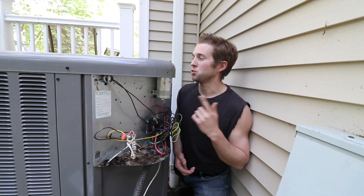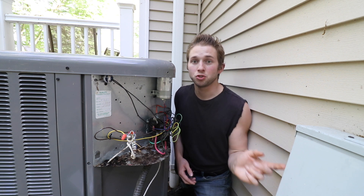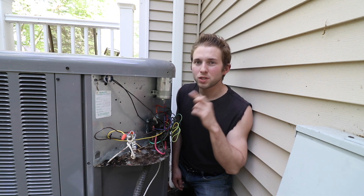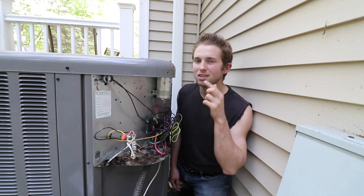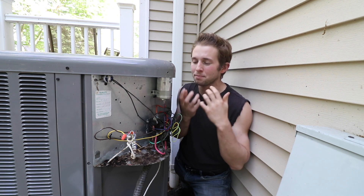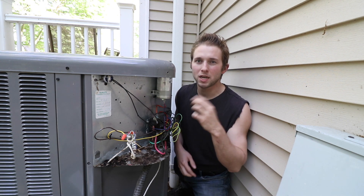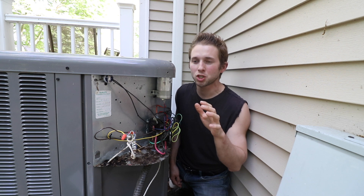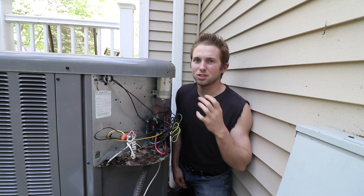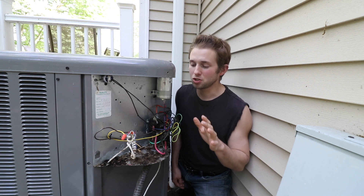This unit is a little bit different. When I realized the condenser fan was not operating, the first thing I did was go to the breaker box and shut off power. You also have to be careful when you start going inside these things, especially around the capacitors, because they're designed to hold charges. Normally on modern units that charge will dissipate as soon as you shut off power, but on some units the charge will remain in the capacitor and it could potentially give you a pretty nasty shock, so just be careful.